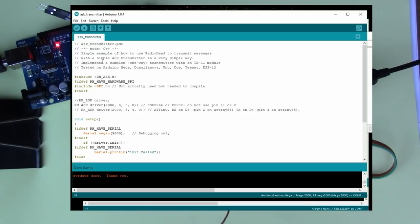So if we look at the transmitter first, the most important thing about this code is we're using this RadioHead module. That's the name of the radio library we're using. I'll put a link in the description down below so that you can go and download this library yourself. It's a very sophisticated radio library, and we're only using a very small subset of its functionality here. So we're just using this ASK, the amplitude shift keying part of the library.